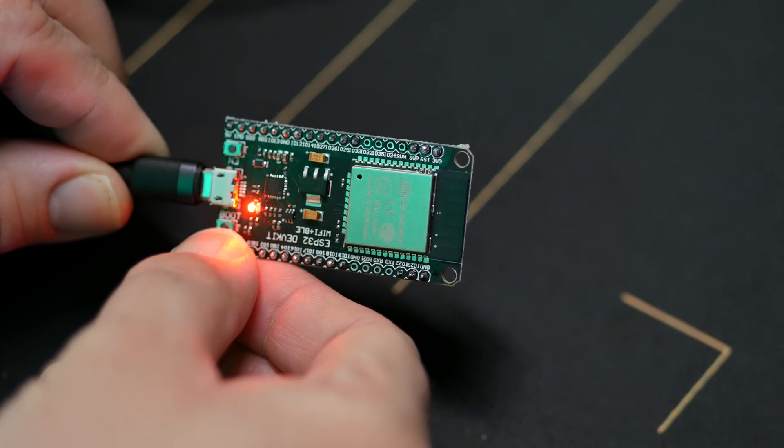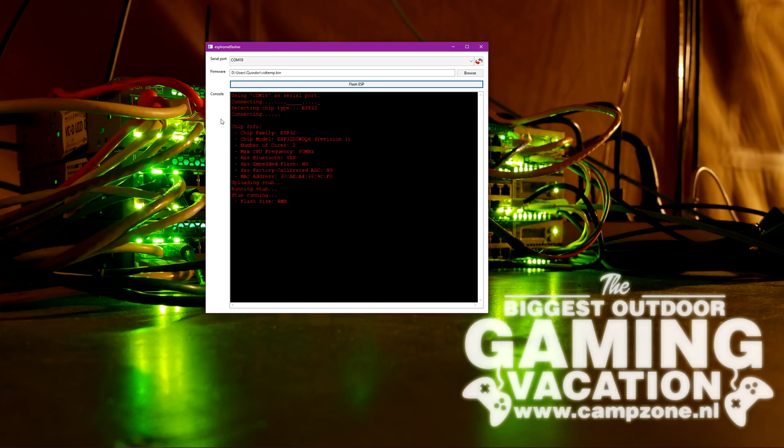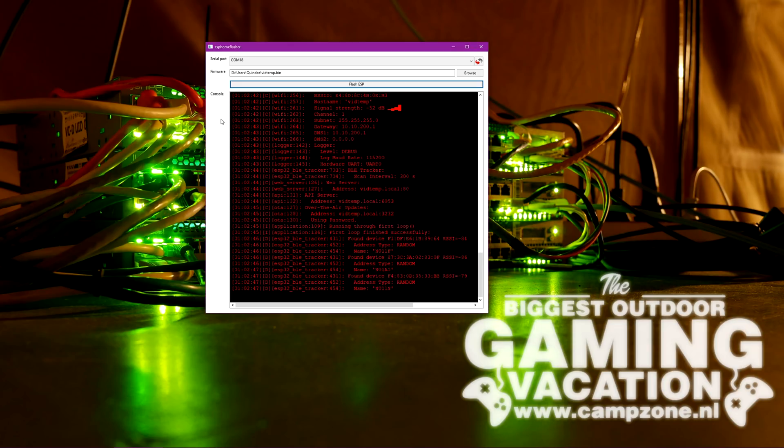Now, sometimes it won't do that because it can't put the module into flash mode all the time. There are two little buttons on this module — one is called EN and the other is called boot. Hold down the boot button while it's trying to flash and you should see it progress and then start flashing. At that time you let go of the button, and while I'm always afraid it's going to go wrong, I don't touch it anymore until it's done. Once it's done flashing, you can keep it connected to your USB port so you can see the serial logging. But since it's now connected to your Wi-Fi network, we don't need the USB connection anymore and we can also do that from the ESPHome web interface. Depending on your home network setup, that's going to work immediately. Or as I showed in my previous video about energy monitoring plugs, I set up a static DHCP lease to which I set a DNS name, and then I can find the module. If you'd like to know more about that, check out that video in the description.